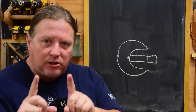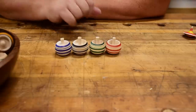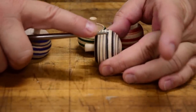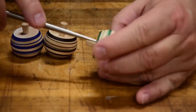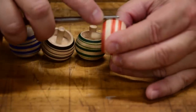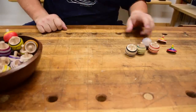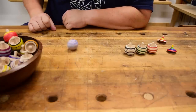Here's an example — I've got four tippy tops. The only difference between them is how far down I've done the hollowing. This one isn't hollowed at all. This one is hollowed roughly a third of the way in but not quite to the halfway point of the circle. This one is done slightly past the center point of the circle. And this one I took as far as I really wanted to go before I blew out the base.